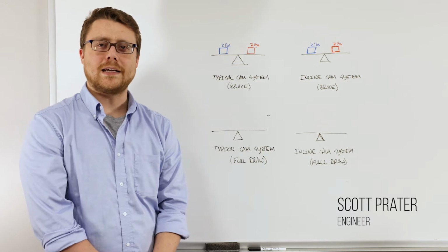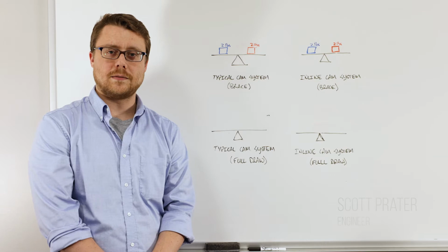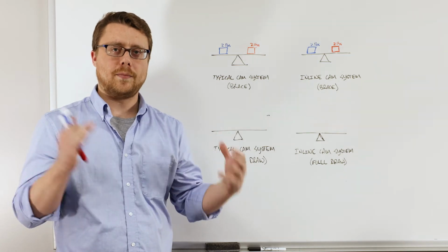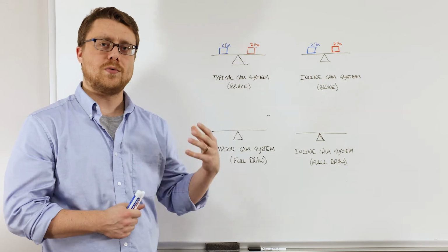I'm Scott with Prime Archery, and I'm here to talk a little bit about the technology behind our new inline cam system. One of the things we've always tried to do at Prime is make sure that the loads on the cam are balanced. The reason we do that is we're trying to eliminate cam lean, which we feel improves the tune of the bow.